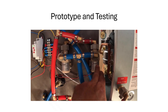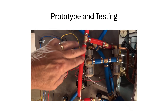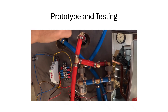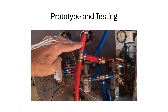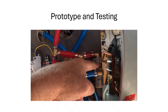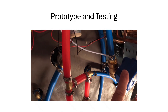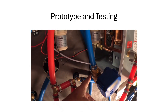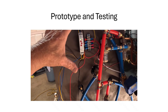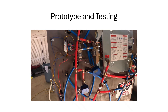So now I've got two of these pumps in parallel, and my plumbing is getting a little bit complicated. What I'm doing is taking my hot water line — the farthest line from the water heater, which would be the shower on the other side of this trailer — and bringing it in, teeing it off to both of my pump inlets. Then my two pump outlets get teed to this electric ball valve, and back into the cold water line, which recirculates back into my water heater.